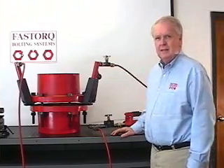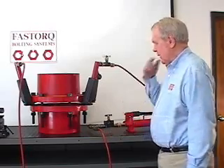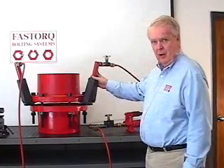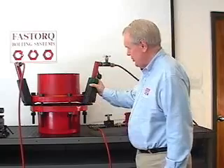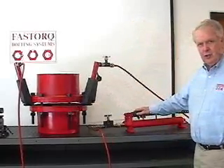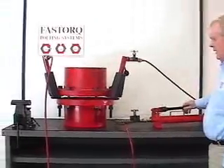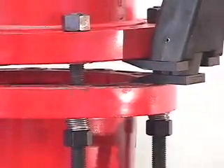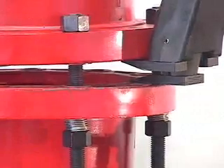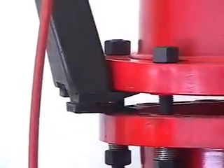The new patented Auto Spreader hydraulic and mechanical flange spreader systems. First, a pair of hydraulic flange spreaders called the HS10K, mounted in a flange and connected to a 100H2 pump. With the valves closed on the pump, we begin to operate it. We can open this flange to a maximum distance of three inches gap — that's the maximum travel of the flange spreader. Each flange spreader delivers 10,000 pounds of lifting and separating force.